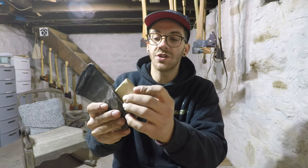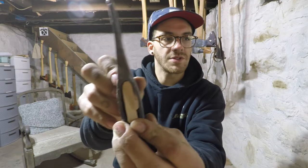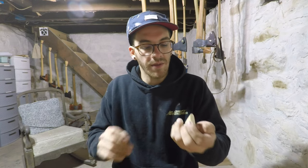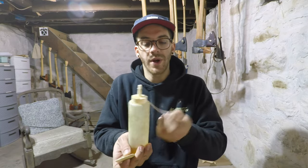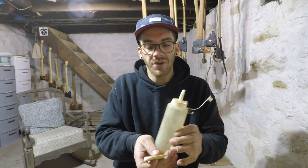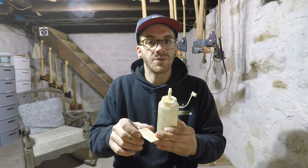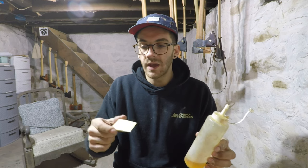We shaped our wedge to fit the eye — you can see it fits down in there nicely, almost the exact shape. Now we're going to seat the head onto the handle for the very last time. You may use glue or put the wedge in dry — I don't recommend putting it in dry. Use some kind of lubrication, whether it's boiled linseed oil or glue, so it adheres almost permanently. I use a little bit of boiled linseed oil so that if you don't have the best hang you'll still be able to remove it and redo it.